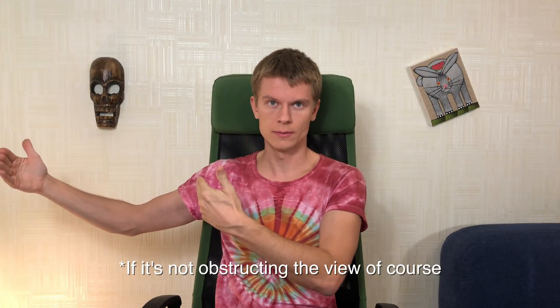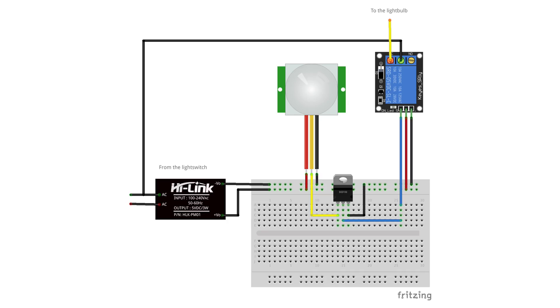That's a huge advantage, but you should remember that this device covers only a 15-degree area in front of it, up to 4 meters, only with some libraries, and it's not very precise. It captures the closest object it can see and will ignore any changes further away. The pyroelectric sensor is pretty good at even 7 meters for a 120-degree area, and it can detect IR changes in the background even if there is something close to it like a wall or a curtain.